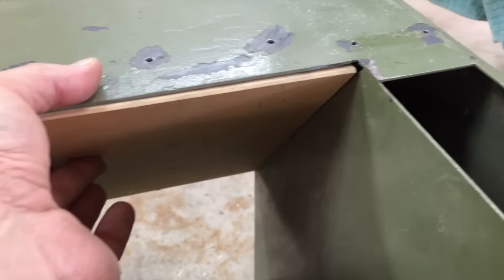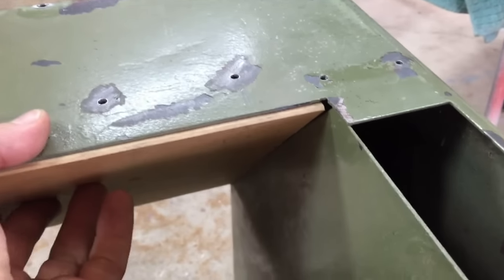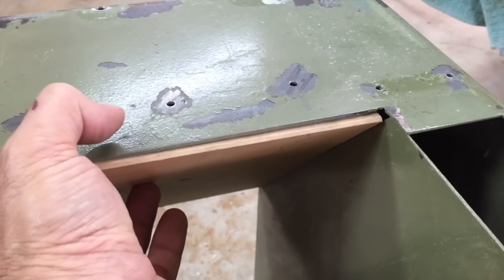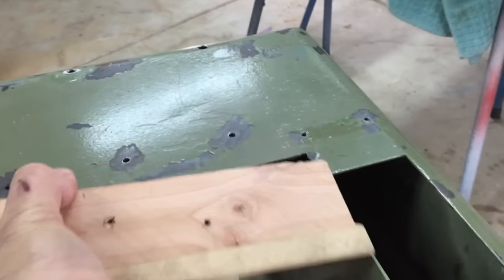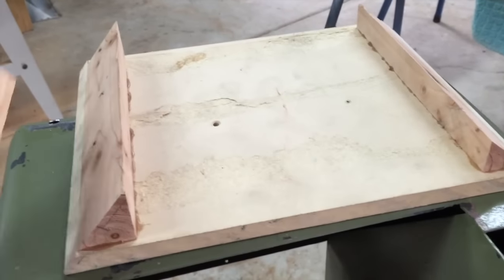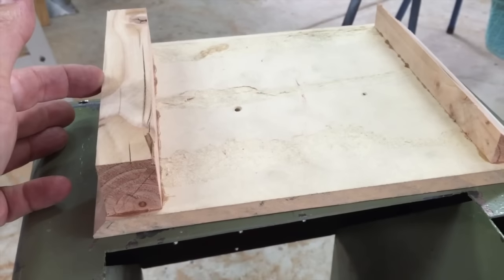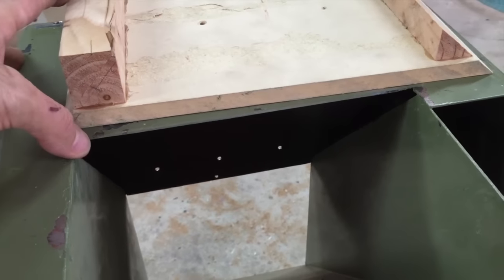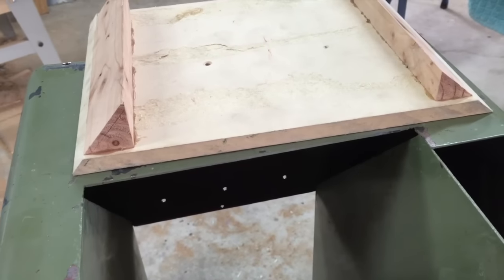To fill in the gap at the top of the dust chute, I just cut a piece of scrap MDF to the right size so it can mount to the cabinet through the mounting holes up here. I originally glued two square pieces of timber on the side of that piece of MDF, and using a bevel gauge I transferred the angles from inside the cabinet to my table saw and then just cut them off at the appropriate angle.